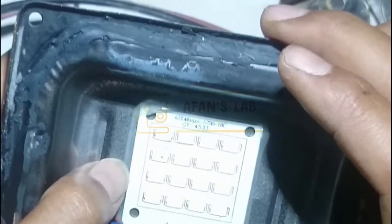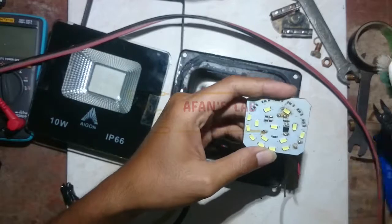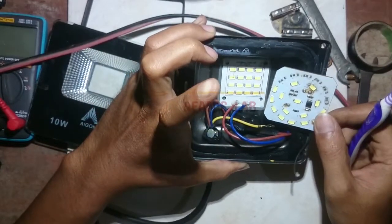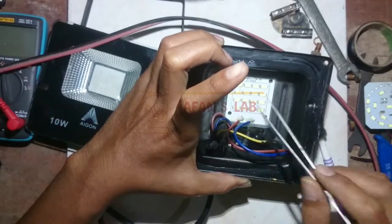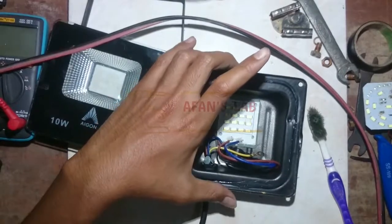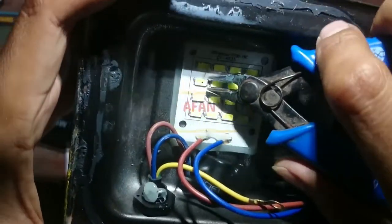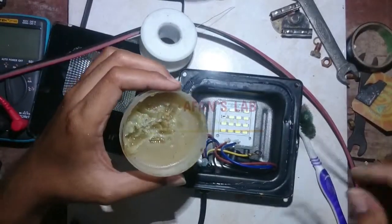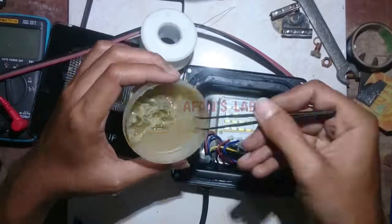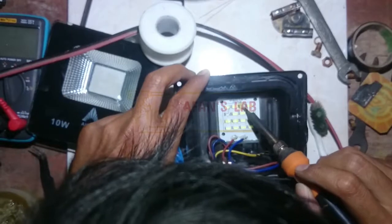I have the same kind of LED from another broken LED light. Use a small wire cutter to remove the LED quickly. Then clean the leftover parts with the soldering iron and pin set.